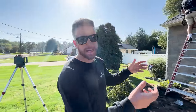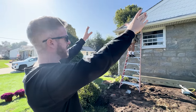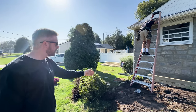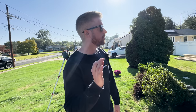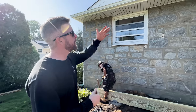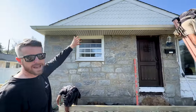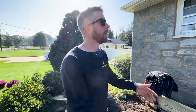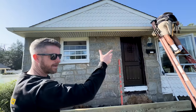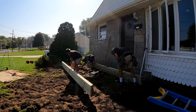We've got the front porch going with a pergola roof coming off the top. We're keeping the existing gable and attaching to that, which dictates the edges of the deck structure underneath. We're going to give the whole front of the house a facelift — not only building the porch and roof, but taking off those old scallop fake cedar shake shingles. We're replacing them with Lost Trail UFP Edge thermally modified wood, and we're going to have some black accents. It's really going to bring this house into the 21st century.